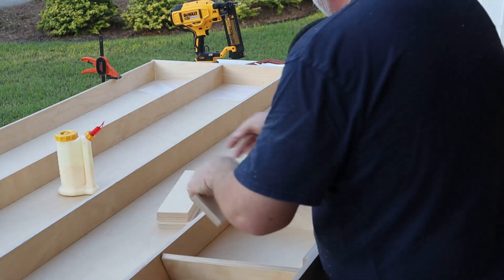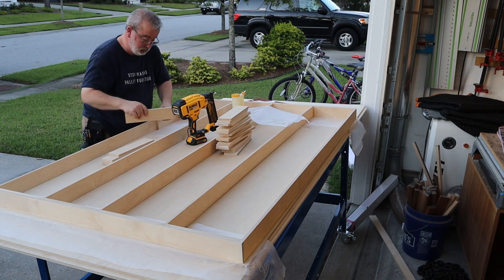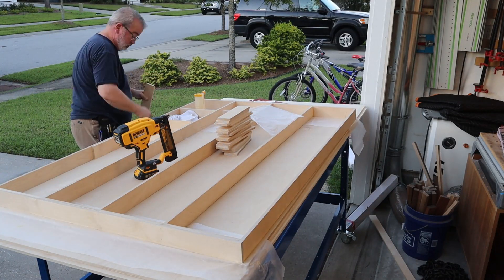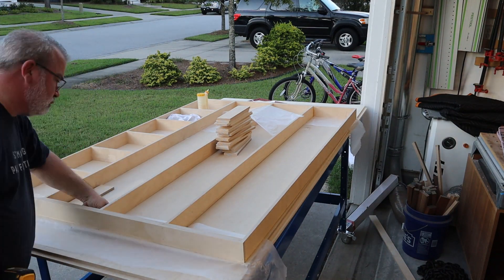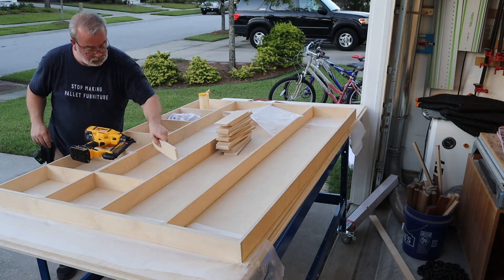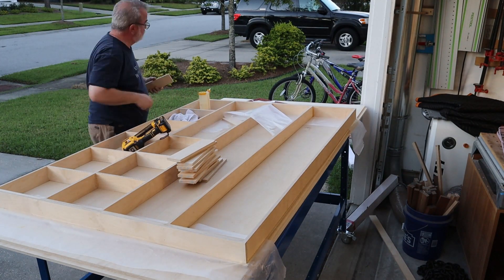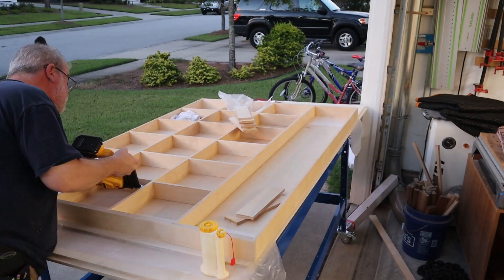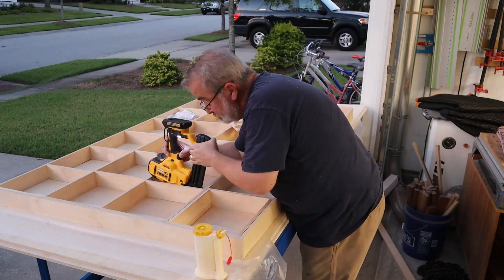Here I'm starting the process of laying out the individual ribs just to get my sizing, and as luck would have it I was able to use spare ribs along the way as spacers. I didn't even have to fuss with squaring this up — just poking in a few nails from each side, and again, this is where the glue really comes into play. From time to time I'm just touching the top of these intersections where they come together. The main thing is to have the ribs flush on the top surface with the long stretchers at every intersection, because once you sandwich this with the top and bottom skins you need the flattest surface you can possibly achieve.